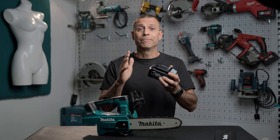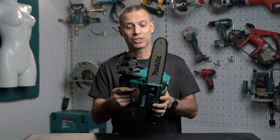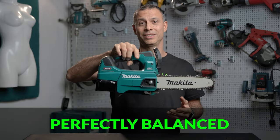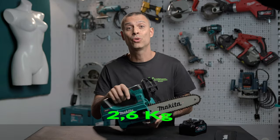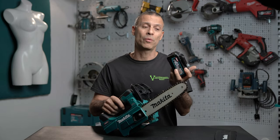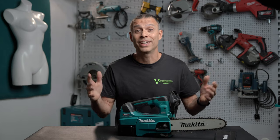It's possible to use a more powerful battery than this one, but they will be heavier. A great feature I found is that with this battery the chainsaw is perfectly balanced, which prevents damaging your tendons of the wrist. The body, without the bar and without the battery, weighs only 2.6 kilos, and with the 25 cm bar, the 4Ah battery, and chain oil it reaches 4.1 kilos — and still remains very easy to use.